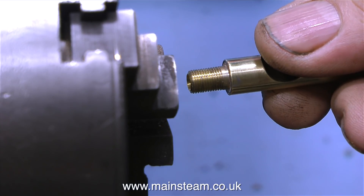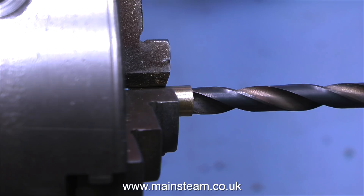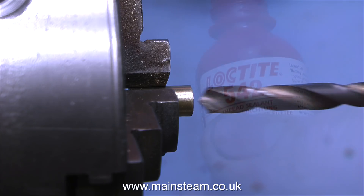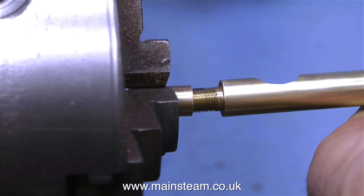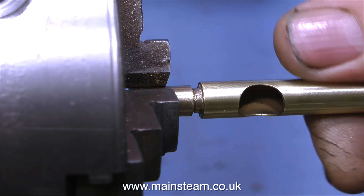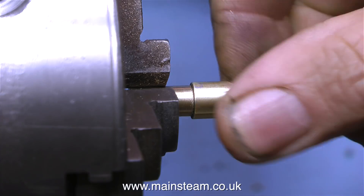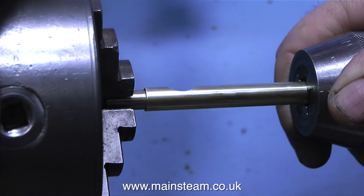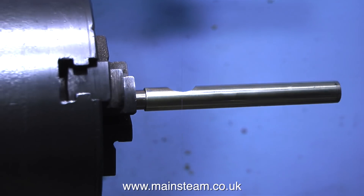The quarter-by-40 thread on this whistle doesn't go right to the end — there's a plain part — so I have to modify the fitting. Using a quarter-of-an-inch diameter drill I just drill down the end of it for a short distance that corresponds to the plain part of the shaft on the whistle. Then I use some Loctite 542 on the threads, because for this application the whistle needs to be permanently fixed to this adapter. To make doubly sure it's a firm fit, I screw the whistle into the adapter, then using the tailstock chuck I clamp the other end to hold it firmly in position and slightly rotate the chuck so the whistle is very tightly screwed in.